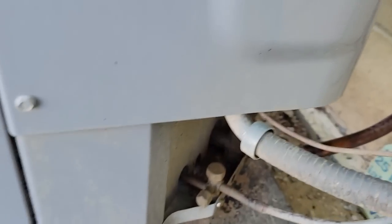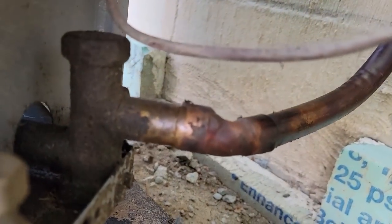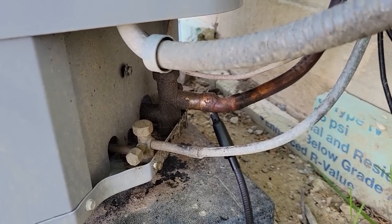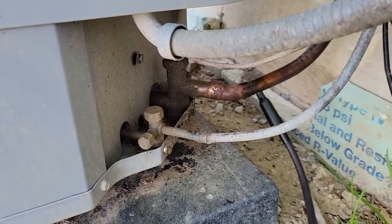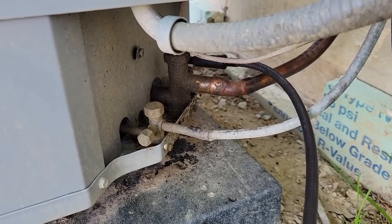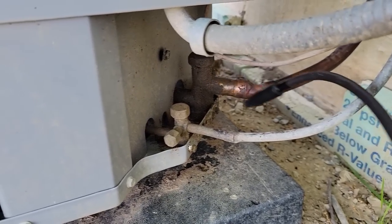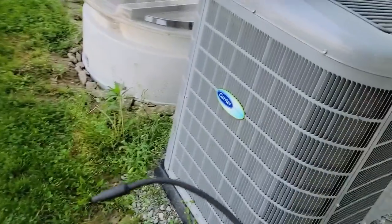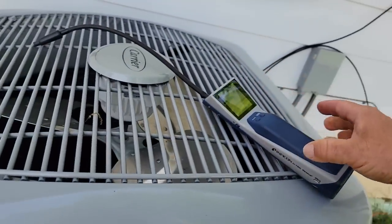Yeah, it's a little gooberfied. It's always on that bottom side where people can't get the heat to it. Is there any up here on all this crap? Because man, oh man, they've got it all caked in there. And then on top of that, they have sulfur water, which has a tendency to cause leaks on the evaporator. So let's go down there and take a look.